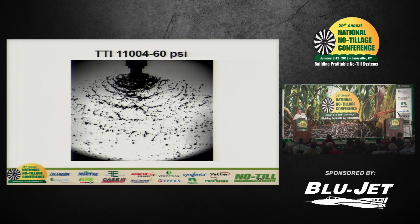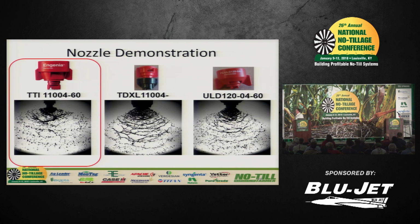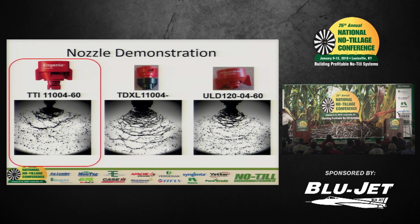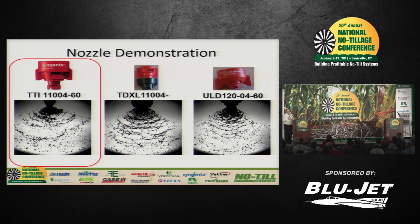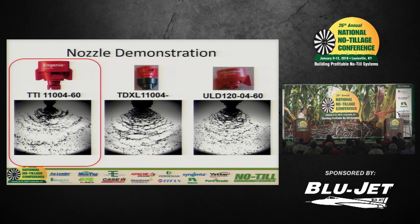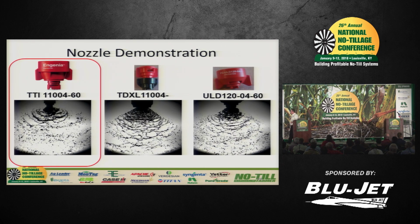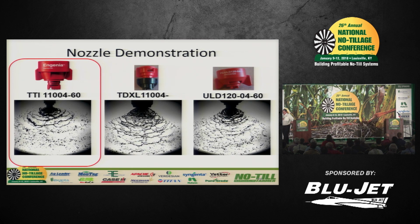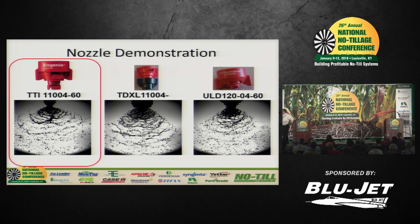Okay, here's the TTI. That's the drift reduction nozzle. Notice how big the droplets are. Then there's a very few smalls. Here's the TTI, the TDXL from Greenleaf, and the Hypro ULD. Now they're all on the list of approval for drift reduction. There are some differences. The TTI on the left is probably going to have your best drift control, whereas the others won't be too far behind it. And those are all approved nozzles for dicamba as well.